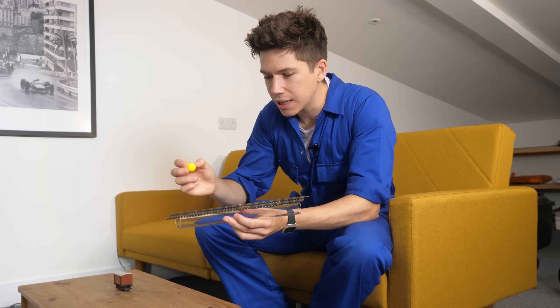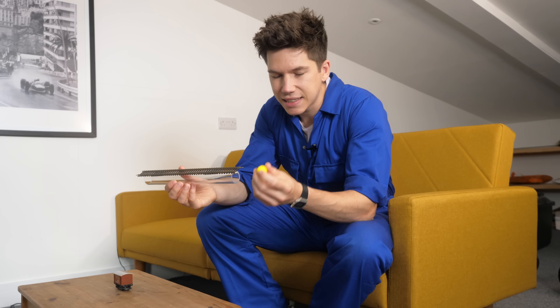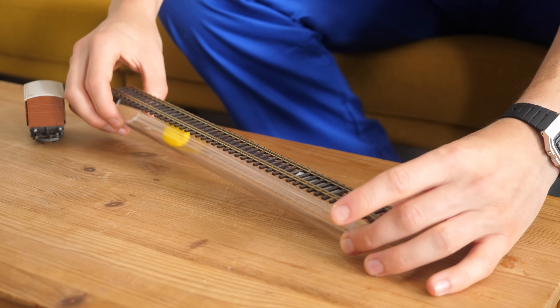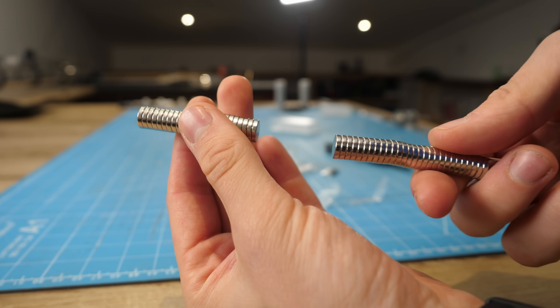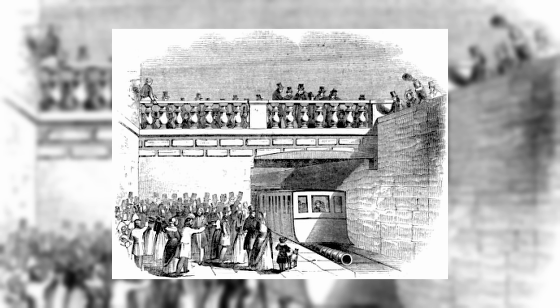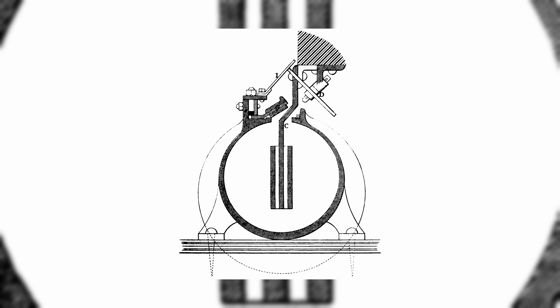It's quite simple really. The idea is to build a train track above a vacuum tube, and this has a piston in it which basically moves up and down due to differing air pressures. This piston, or thrust carriage if you want to call it that, can be coupled to a train above the tracks using high-strength magnets. This concept is actually a really old idea, but due to limitations in technology, it never really caught on in a big way.